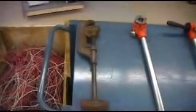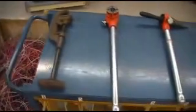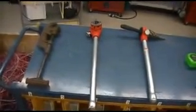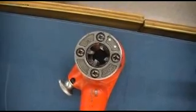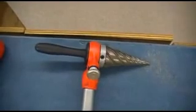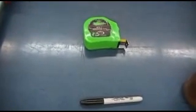So look at the tools you'll need. First of all, the pipe cutter to actually cut the conduit. This one is mine from home because all of our pipe cutters here are broken due to students not using them properly. Also the threader itself — you can see the threads in it. These will be half inch; we're doing half inch RMC type conduit. Then the reamer, which is a little bit different for the thick conduit. Also a tape measure and sharpie to measure and cut the conduit.